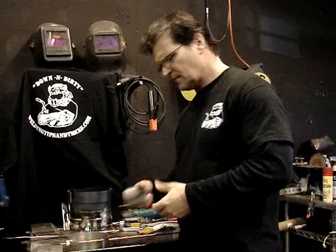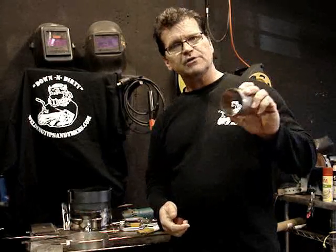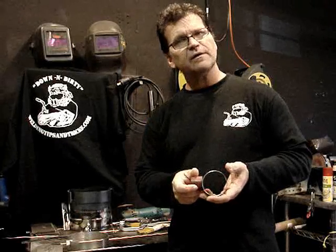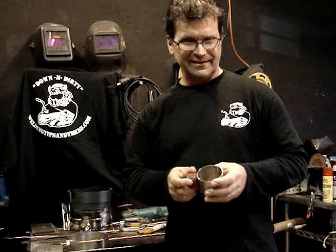We're going to stainless steels now, and let's talk about some of the properties of stainless steels. I've got a piece of 304 stainless steel that's been rolled here — non-magnetic. I've got a pretty strong magnet here. I can feel a slight, very slight pull. It will not even hold the weight of the stainless up. But it's basically non-magnetic.